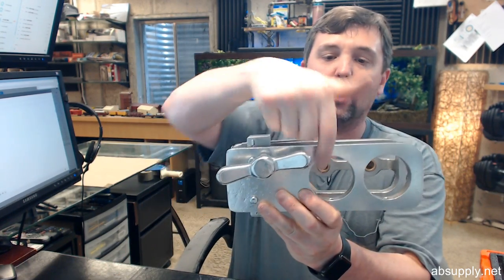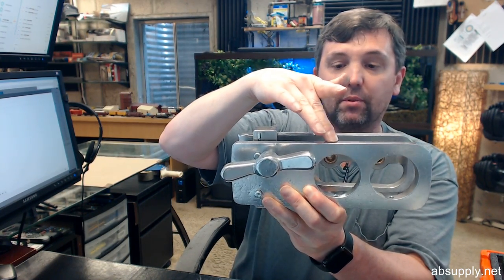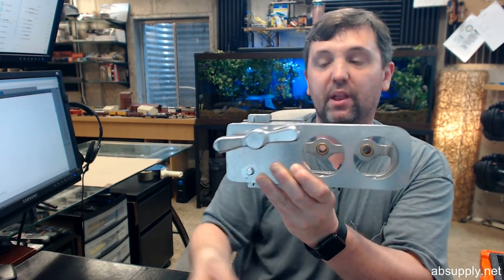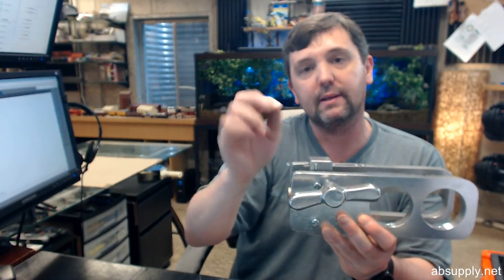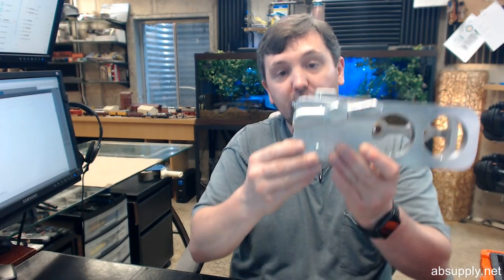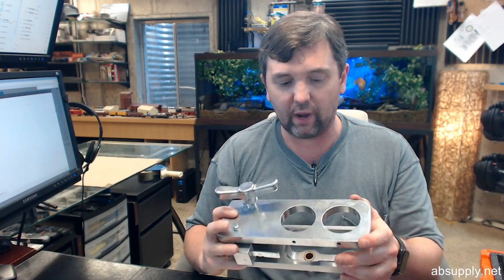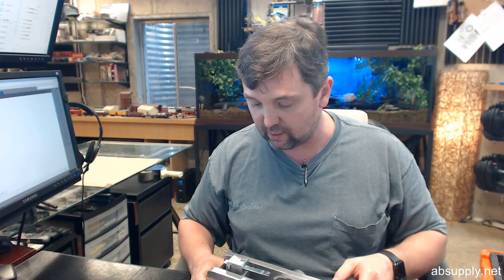I suppose I might try doing something like, knowing what my center line is, and knowing what the deduct is for the top of the plate, and then what the adder is for the bottom of the plate. And I might make 2 real small pencil lines on the edge of the door to mark the top and the bottom. Bring that down and just center my tool on those 2 lines and be done. I might do that. I might experiment with that for a while, or just come up with another way of doing it. So I had mentioned loading it with the bits.